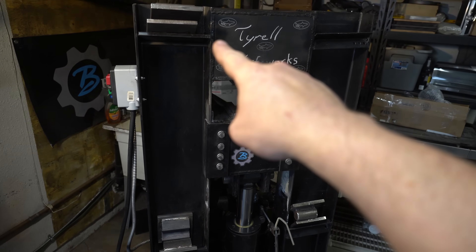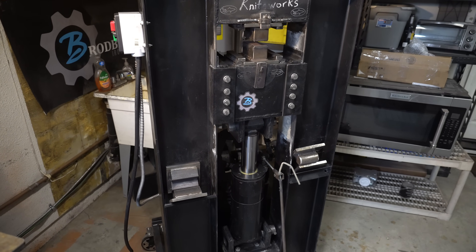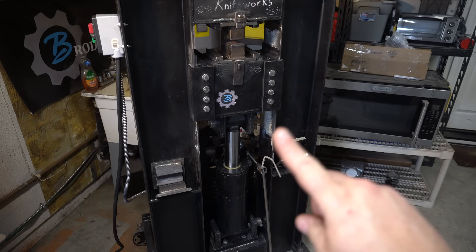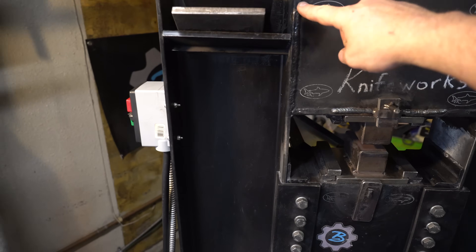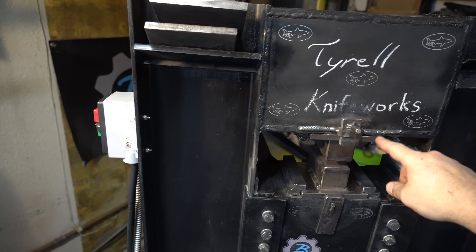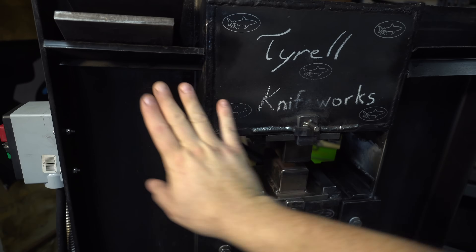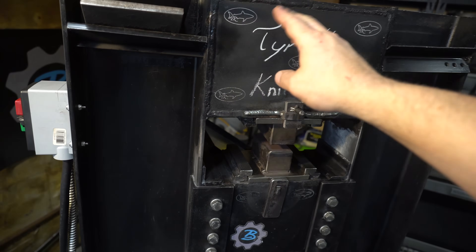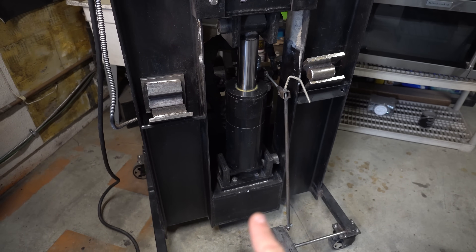It's five foot tall, top to bottom. I went to the steel yard and purchased the I-beams and got them cut to length. I also got them to cut a twelve inch piece for each cross member and a twelve inch piece for the head. Then it was as simple as welding up the seams. I also put some angle iron inside the I-beam just to make sure there was no flex — probably overkill. The bottom is welded the same way.